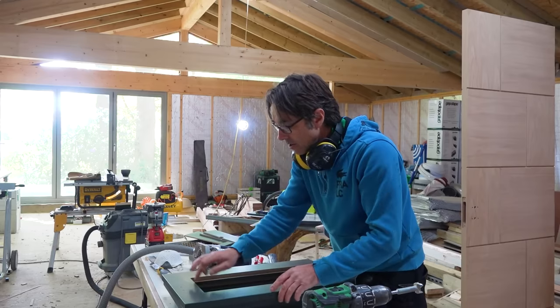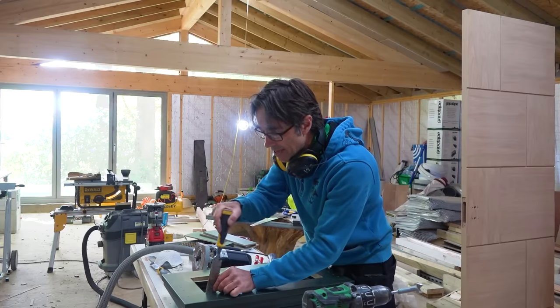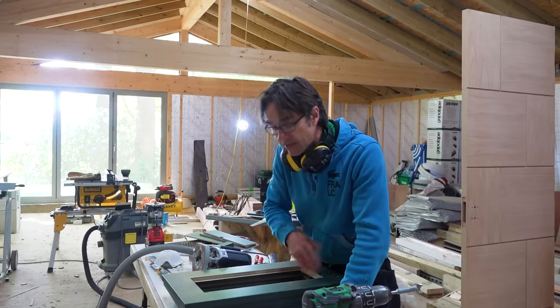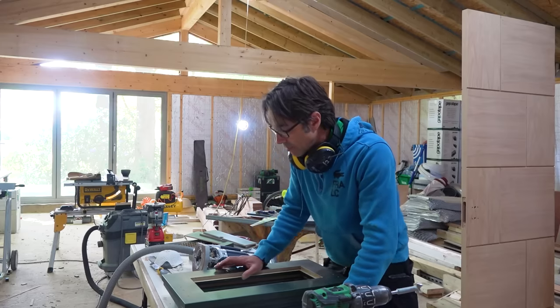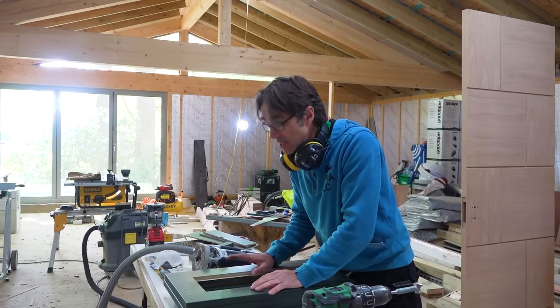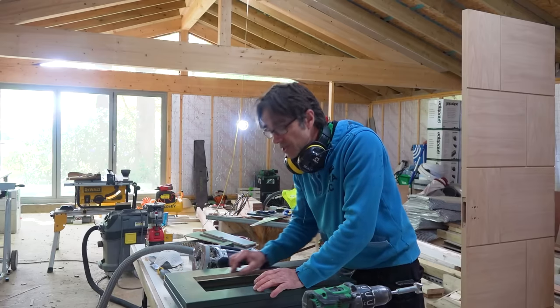I finished the corners off with a really nice sharp chisel, just pared them back and cleaned all that out. I've taken the arris off. Now I'm just going to go and prime these and get them base coated ready for the painter, so he hasn't got to do that. Then we'll rehang those once they've been fully finished, put the brass panels in, with a nice hockey stick moulding on the back which will be mitered and pinned with my little air pinner.